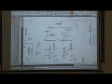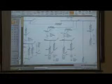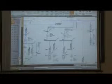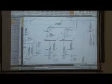You have to switch something because we want to work on this bus and we want to work on this bus. The first thing to do is look at where the power comes from. Well, there's a transformer and the power comes from this bus, which is 13.8. And the other one comes from the same bus. Interesting, but that's just the way it is. The buses have names. This is 7, this is 8, and this is transformer 9, and so on, and they have ratings on them.